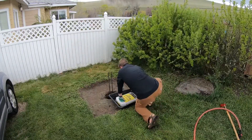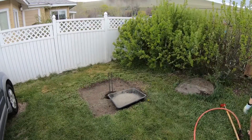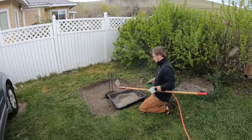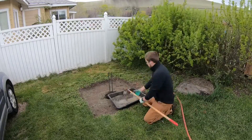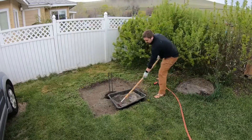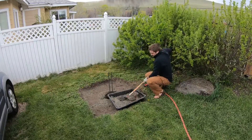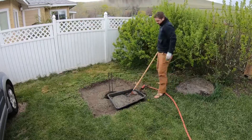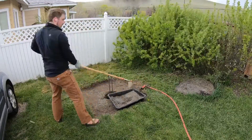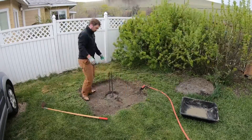A couple of things to look for when pouring concrete: don't get it on yourself and try not to inhale it — I'm holding my breath every time I dump the bag. It's just not the best stuff to breathe in. Also, get pre-mixed concrete and don't mix your own. I recommend not the fast-setting kind. I use standard Quikrete high-strength, and I like the 60-pound bags because they're a little more manageable than the 80-pound bags.